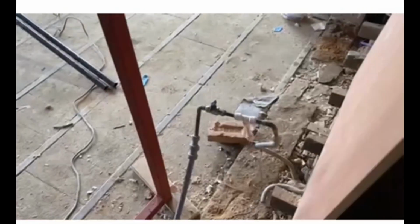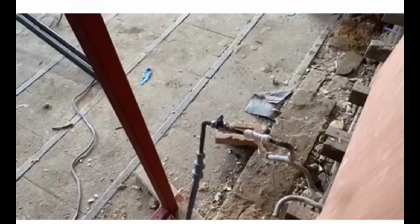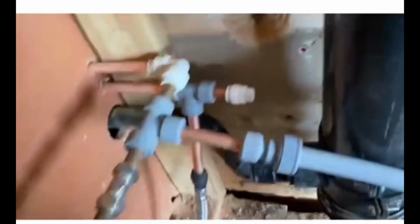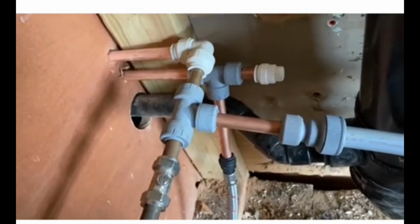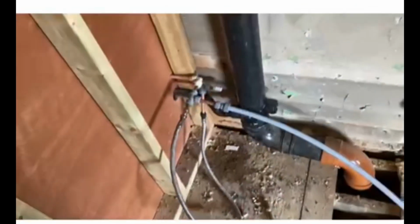So I'm testing today and I've rigged up, we're on a building site. I want to test all my hot and cold pipe work, my heating pipe work. So I've rigged up a main to the main hot and cold and I've looped them in here. But I've got an unvented on this system, so I don't want to put 6 bar through the actual cylinder. So I've linked them upstairs as well. The hot and colds are linked in here, in this installation.